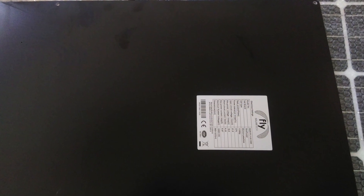These panels are solid black with a stiff aluminum metal backing plate, making them semi-flexible rather than truly flexible. With that backing plate sitting flat on the Bimini fabric, there's not a lot of cooling going on — and solar panels will definitely drop their output as they get hotter. We're boating in the Mediterranean, which is very hot in the summer, and if you put something black outside it's going to get extremely hot.